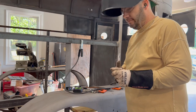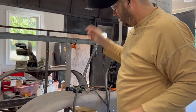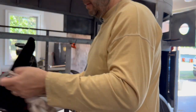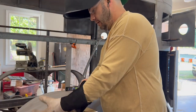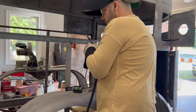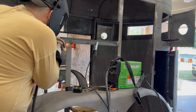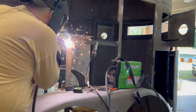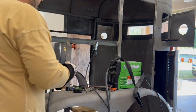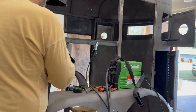That's how we fab up this bottom bar and tack it in. I went ahead and trimmed up this vertical flat bar and I've got a C-clamp in there to hold it plumb with the angle. I'll go ahead and tack that in, take the C-clamp off, and finish welding. There's the tack — I'll run a bead.